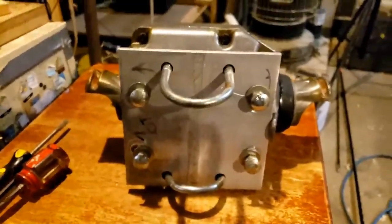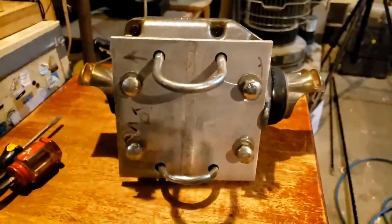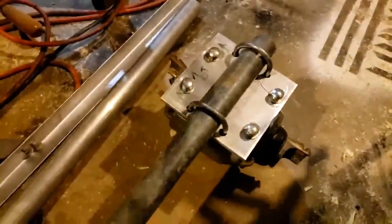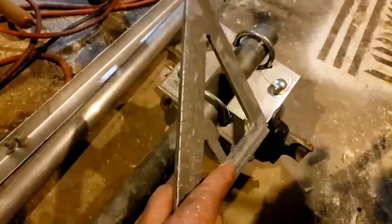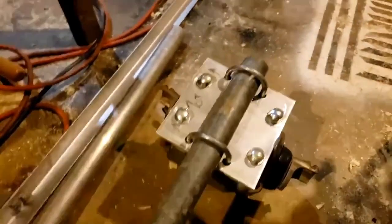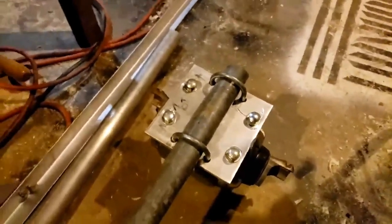The mast mounting plate is on — I think I got it square with the rotor, as square as I can get it. I'm going to mount this to the pole. The rotor is mounted to that plate and the plate is mounted to the mast. I used a carpenter's square to square it up — it has a lip on the bottom that rides against the pipe. I just butted it up to the bottom of that plate, squared it up, and tightened the U-bolts.